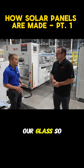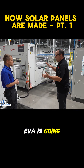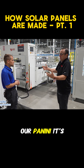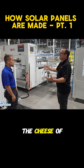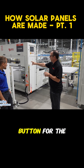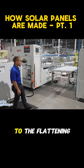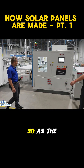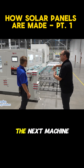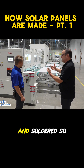So we've got our glass — what happens next? Now we get our first layer of EVA. EVA is going to act as the binder of the module — it's the cheese of the panini. The glass comes through, it gets automatically fit and cut for the EVA layer, then works through to the flattening machine so the EVA layer comes out flat, all the wrinkles removed, ready to move on to get the cells placed and soldered.